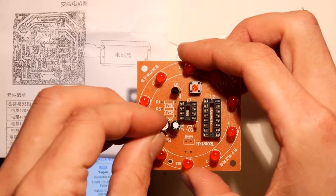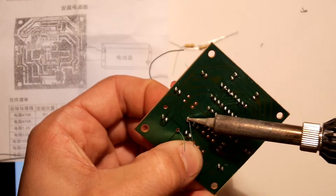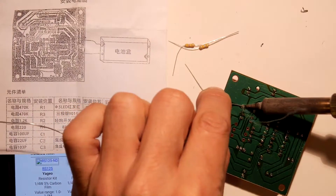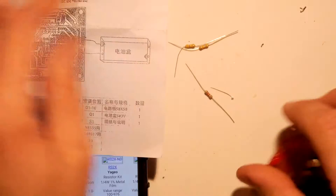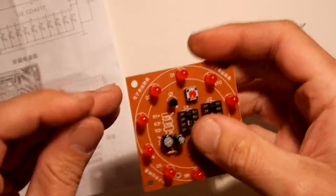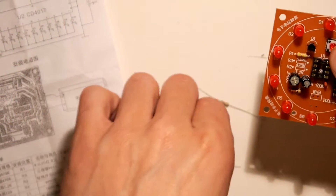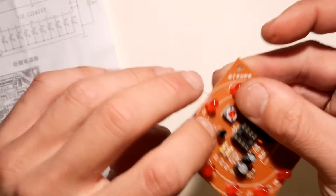If you're a bit more skilled you could bend the legs in a bit tighter. Do the same trick - flip it over, get your blob on there, tack it. The resistor is still sitting nicely. I'll go straight ahead and tack the other leg too since they're a bit flimsy - if you cut it first, chances are it'll fall out. Now the two 470k resistors - R1 and R3 - fold those legs back. You'll find in old through-hole electronics some interesting ways people put resistors in, like standing them on end, which was probably a space-saving trick.